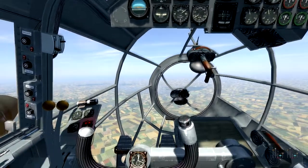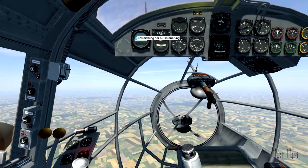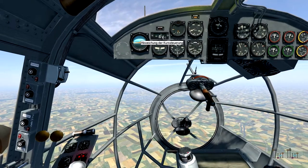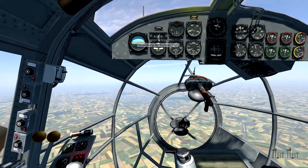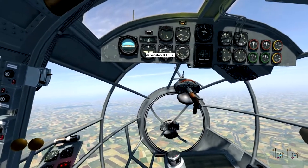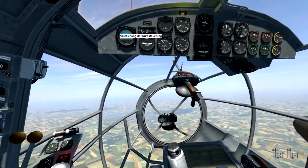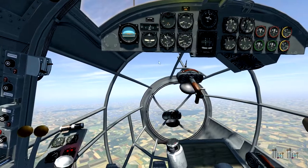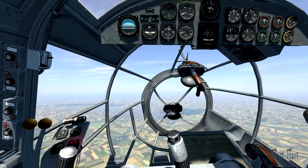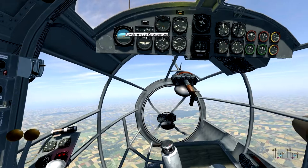On the left side, also overhead, we can see what the autopilot is actually doing. This instrument shows with an upper white marking whether we are on course. If it's to the right the autopilot has to change course a little bit to the right, and if it's to the left, vice versa. Changing the course now — pushing the switch to the right — the autopilot sees the desired course change and follows the white marking, trying to get it centered again.